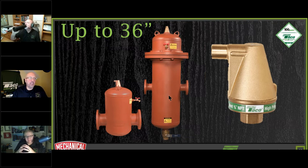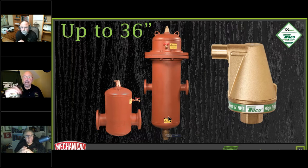So here, they don't go in brass. We do this in steel in our Fall River facility, and we have the same basket of Pall rings. The Pall rings are just bigger. You look at these Pall rings in here, and they're about a 3/8 of an inch diameter. When I look at the ones that go in these units, they're about that big. And the same float mechanism that you see in here is also there. And these are also a high pressure mechanism that we have. So here we just have the basic float mechanism. And the ones that go on these 4900s, actually the float is longer and drops down inside the tank itself.